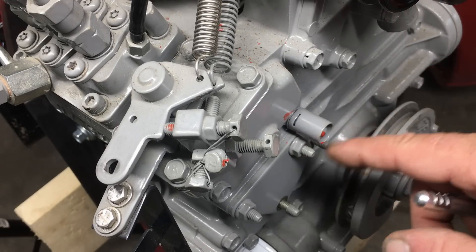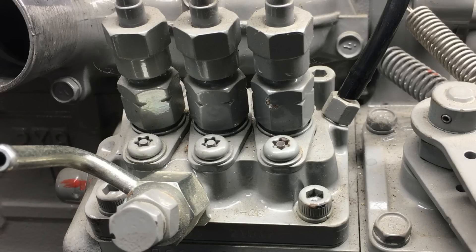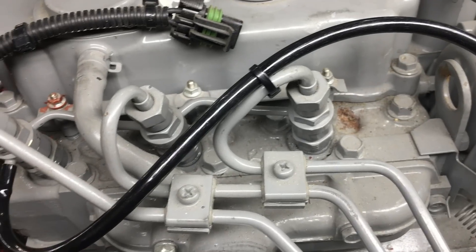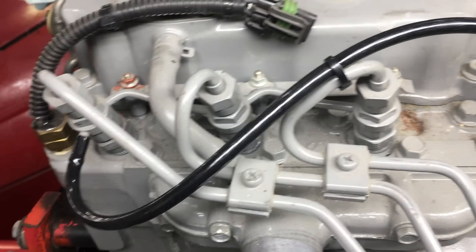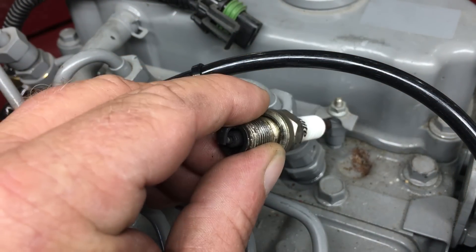Adjusting the fuel setting is what makes the engine roll coal, as they say, but once we add boost to the equation it all works out. Being that this is an industrial engine, it lacks variable timing for the injector pump — it's likely tuned for best performance at a single speed. However, we do have a way to modify the timing slightly by removing the shim between the engine block and the fuel injector pump, which advances the timing slightly — something we may explore down the road. This engine doesn't have spark plugs — instead, it uses glow plugs, and they're only necessary to get the engine started. Once the engine's running, the glow plugs are turned off and the fuel ignites by compression alone. It's a pretty cool system.